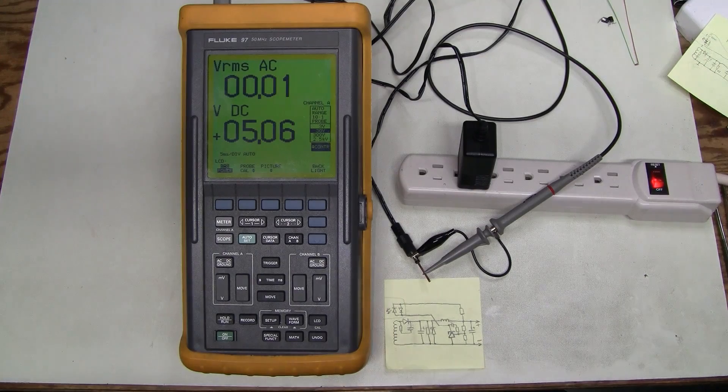The supply is back together in a slightly damaged case. I hope this investigation was interesting and educational — in particular how a slightly beefier Zener, or perhaps a slightly faster fuse, or maybe an additional surge protection on the input like a varistor or something like that, which is worth a few cents, might have saved an expensive piece of equipment. If you liked this video, give it a thumbs up. It helps. Thank you very much. Bye.